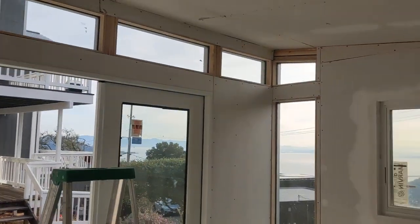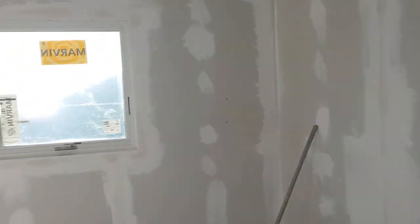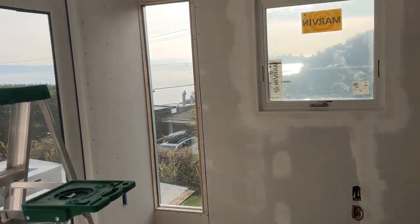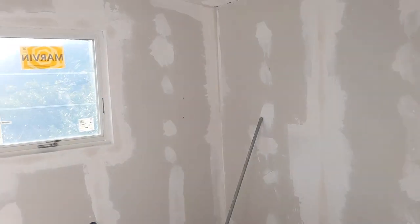Okay, this is day five. We're getting rock on. Got most of it rocked here. And I've got a little bit of my first skim coats and gap fills. But today we will tape and mud it. And then tomorrow, I'm going to have to put a space heater in here or something to get it to set overnight. But then tomorrow will come sand and paint.